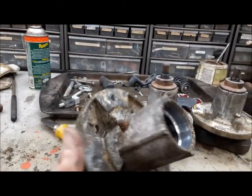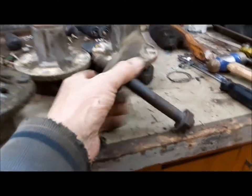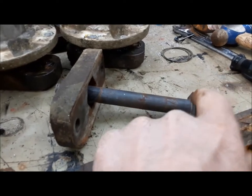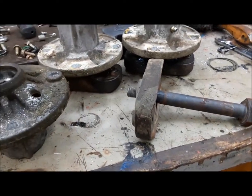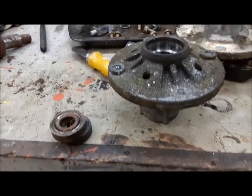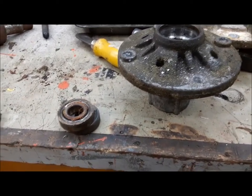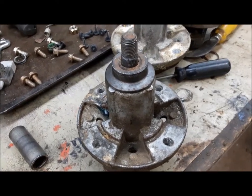Now I'm going to use the leftovers and see if I can make one more for a spare. I'm going to put one of these loose ones here and center-punch it so we can get it back tight in its bore — that's about all we can really do in this situation. We've got two bearings left; we'll put them in, pump it full of grease, and we've at least got a spare spindle if we ever break one. Here's a good spare we can box up and keep for a rainy day.